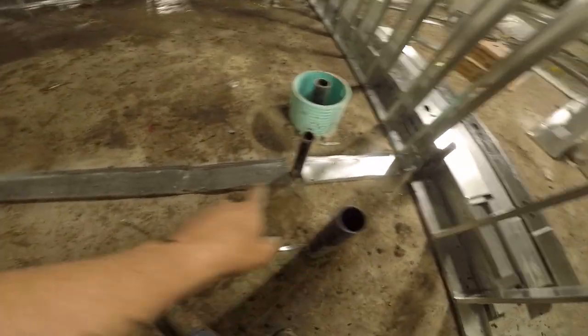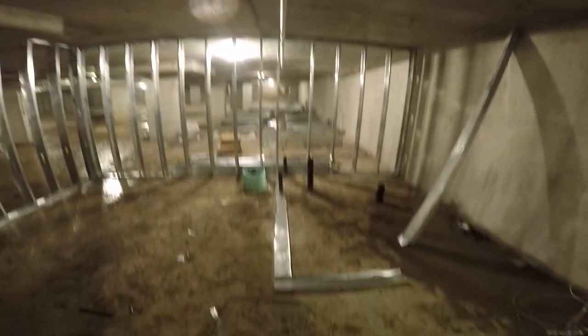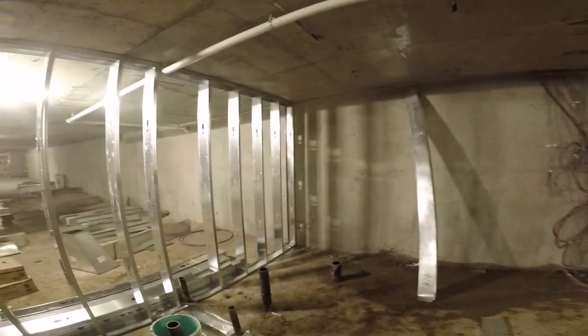Can't finish this section because this run is right in the middle of where the wall is supposed to go — it's directly above the wall. I have to wait to see what they say about that before I can finish. But the rest is done. These take a long time because almost all the studs are different sizes due to all the different slopes and heights. You have to lay studs out top and bottom and measure every one, so it takes time.